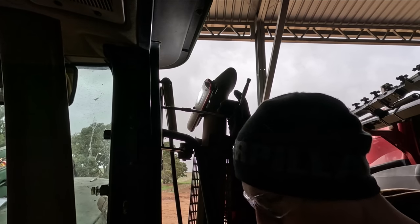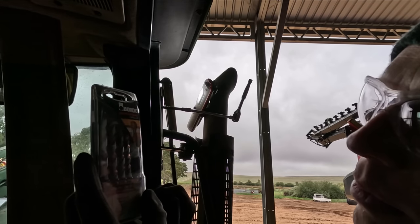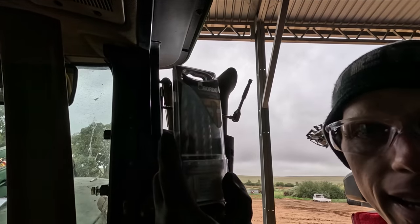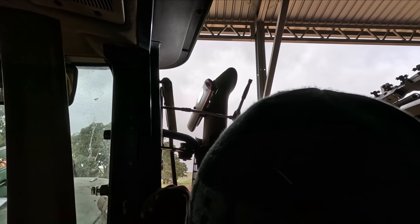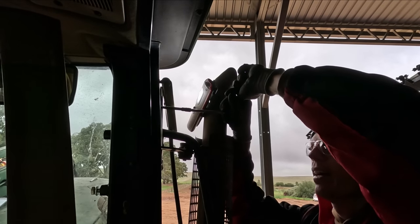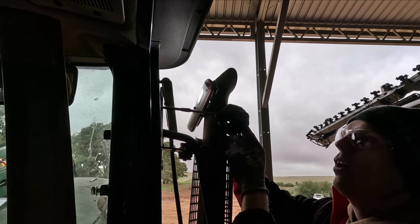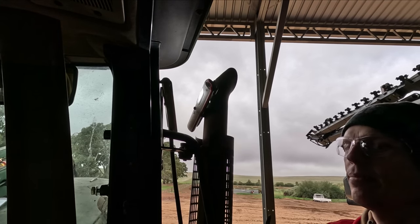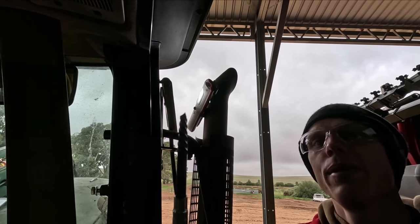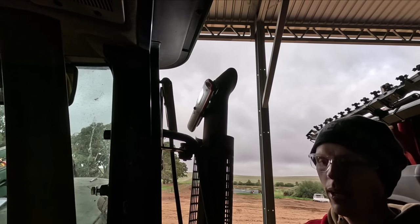And that's when I remembered that I have these diamond ground titanium carbide tip drill bits, and they would drill into that bolt. So I've got a hole in there, I've got my easy out, let's see how we go. Oh, you're gonna come out, aren't you? No, oh, you're kidding me. What do you do when the easy out breaks in there? That was turning too. Why did it break?